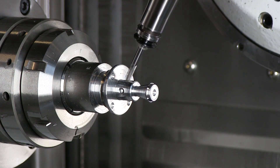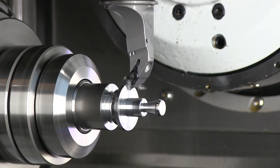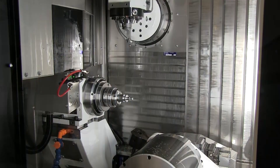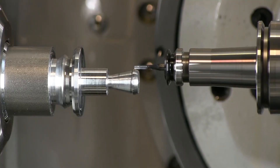What about the spindle and the tool change time? The spindle takes HSK E40 as standard, and we have other options if you want it. Tool-to-tool time is around 0.8 of a second. That's a quick tool change time - it shaves off a few seconds of the cycle.